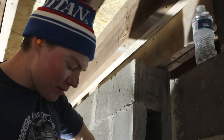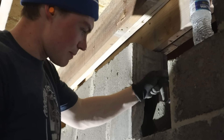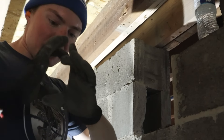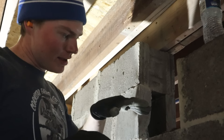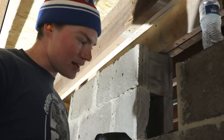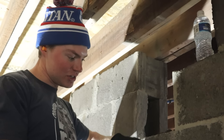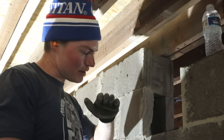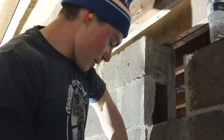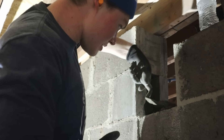We're doing this so that way we ensure the new beam has great contact area on top of this block wall. Since it's made up of a bunch of squares, sometimes the block wall can end up right in the center of a square where there's nothing actually putting contact on the bottom of the beam — it would just be the edge of the cinder block. We want it to be the whole cinder block, so that's why we are filling the center with concrete, distributing the load.